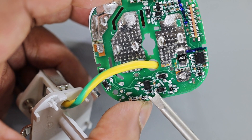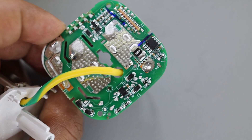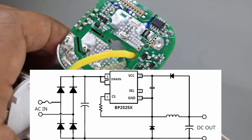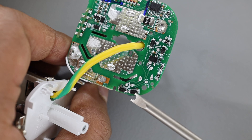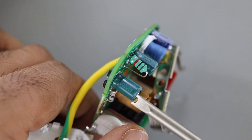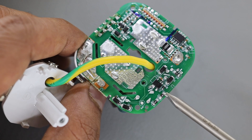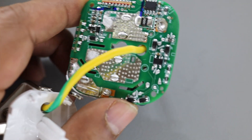This IC is BP2525OCSK, and this power management IC is HLW8110. Let's first look at the datasheet of the regulator IC, the BP2525. The datasheet is available and the circuit is given directly on the first page. You can see there are four diodes for rectification, but in our circuit we only see two diodes — it appears IKEA is only doing half-wave rectification rather than full-wave rectification. That capacitor is mentioned in front of the regulator circuitry. This inductor is most likely for filtering, not primarily used for power conversion. And then you have the BP2525 part itself — the high-voltage DC-DC. Two diodes are also in the circuit, and this inductor is the primary regulation inductor. It almost exactly matches the reference design.